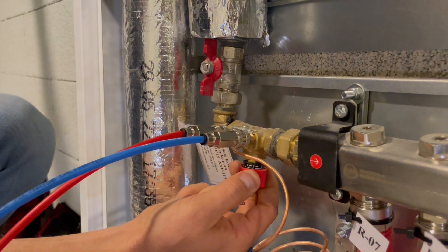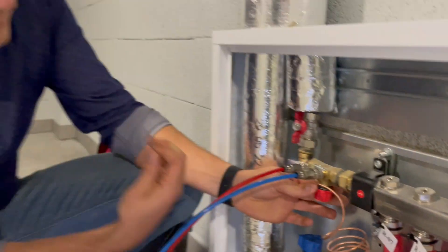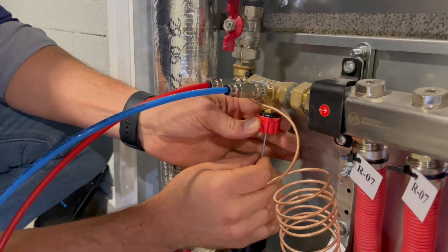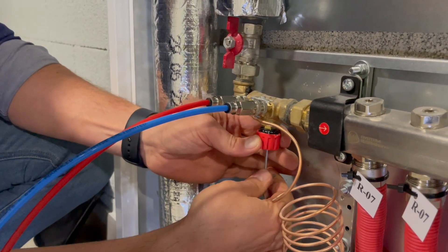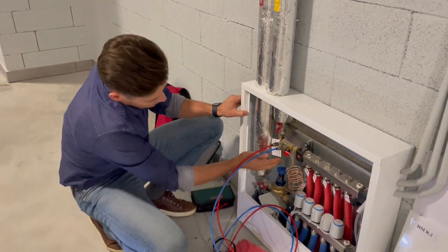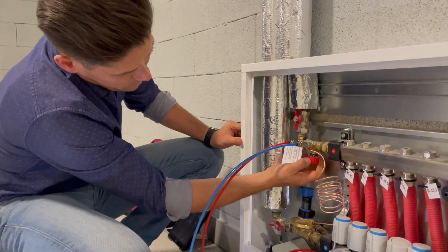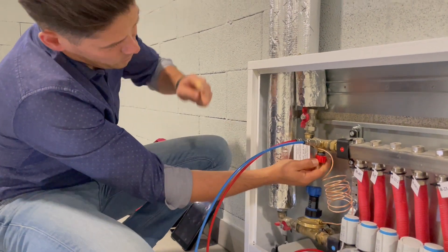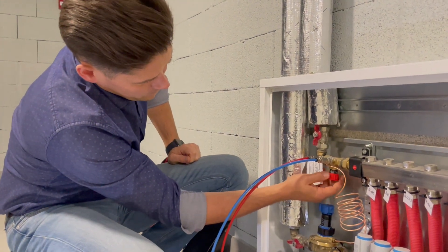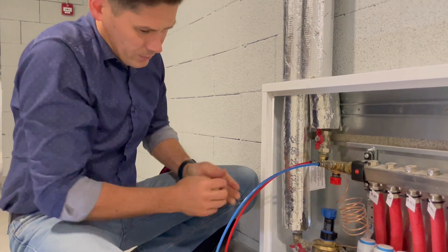So here is the marking and I put one, two circuits and 2.2. You have to have an Allen key — two millimeters I guess. This one is for the DN15. Control clockwise — I have to lock it. Now it is locked. And I have to open the knob. For checking I can turn it one, two, 2.2 — so my locking is right.